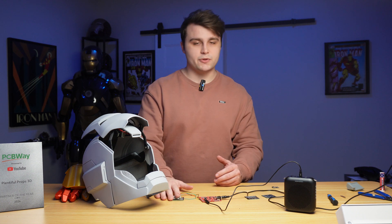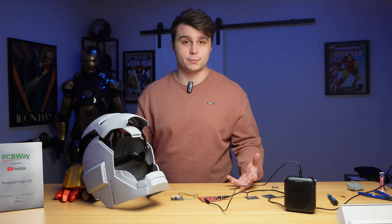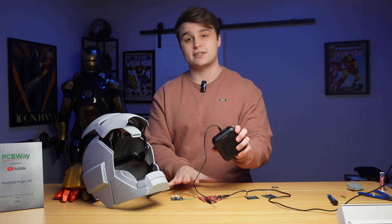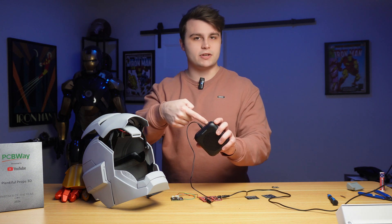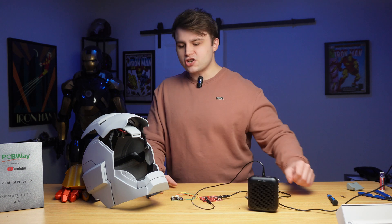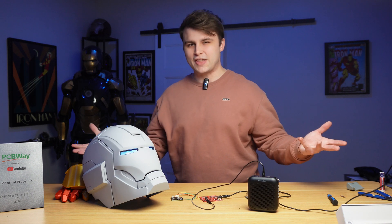I haven't developed a proper PCB for the sound effect module yet, but I will in the very near future. I won't be sharing the code or PCB just yet — I want to release everything once all the Iron Man suit systems are developed, so all you'll have to do is upload the code with the correct MAC addresses, upload the sound effects onto the SD card, and you're off to the races. I also have this plugged into a voice amplifier which has both an aux port and an additional mic port, so I can plug in a wireless communication device for a wireless headset inside the helmet.